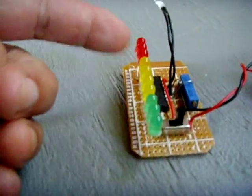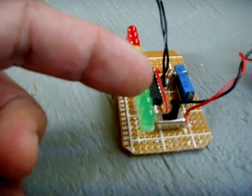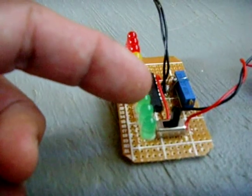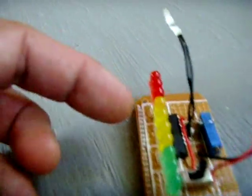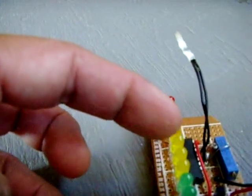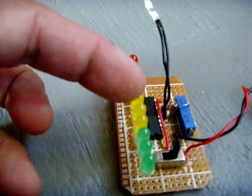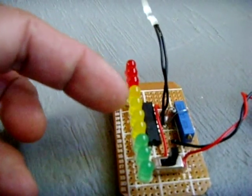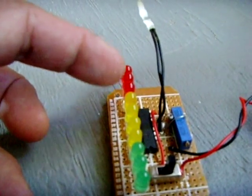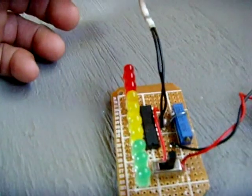The third green LED illuminates at about 140 degrees when it just turns on. The sixth LED, which is the amber colored one, illuminates at the boiling temperature of water — 212 degrees. It goes way up to like 280 to 300 degrees, but you could adjust the range by playing around with different size thermistors and the value of the potentiometer.